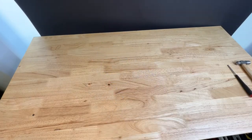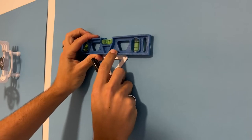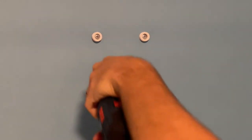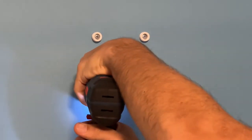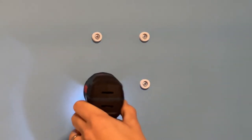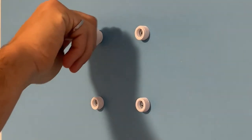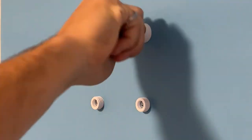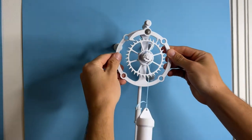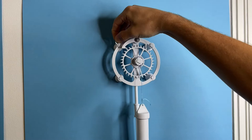Attach the pendulum onto the escapement, and once it's screwed all the way in, we're ready to go to the wall. Line up your wall mounting guide in whatever position you want and make sure it's perfectly straight using a level. Mark the holes with a pen or marker. Using whichever wall mounting method you want, screw the wall anchors into the wall — here I'm screwing directly into the drywall and it's strong enough. Make sure the wall anchors are super tight, then screw the wall posts directly onto the anchors.